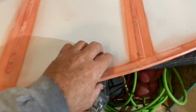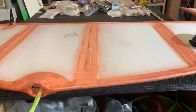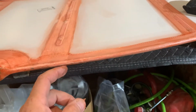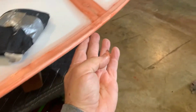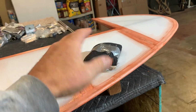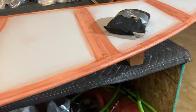And then, because it gets kind of shaky, that's when you just take this and put it on top of the end of one of those, and it'll hold it nice and steady while you work on it. I do this once I start doing the tapes and stuff, so that way I've got room to work. And then especially nice when you're doing the poly brushing, because then you can get up underneath the edge with your brush, make sure you don't have any run off there. And by doing this, it lets you flip them over pretty quick. And then if you did have any where it kind of spilled over, ran down through here and you didn't catch it, then you can see it on the other side in time and get it off with your brush.